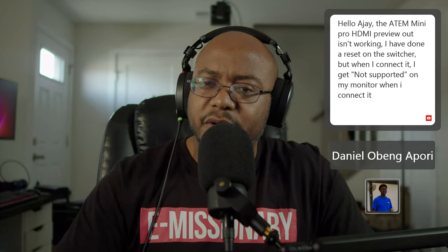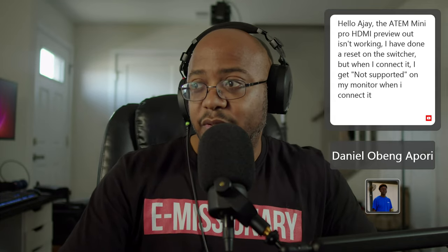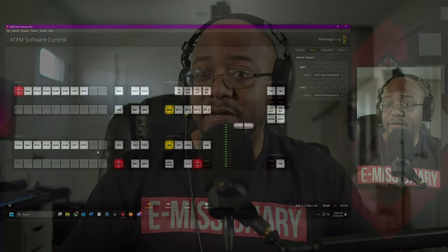Daniel: Hello, AJ. The ATEM Mini Pro HDMI preview out isn't working. I have done a reset on the switcher, but when I connect it, I get not supported on the monitor. That means that you need to change the settings on the ATEM. Most likely your monitor does not support the setting that's in your ATEM. That's what that message is. So it's not that the multi-view is not working. It is working. It's just the monitor that you have connected to it doesn't output.